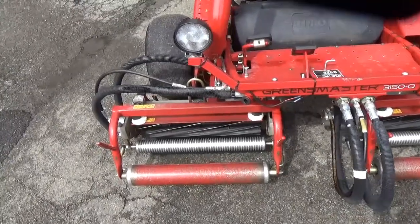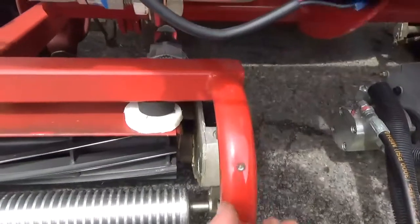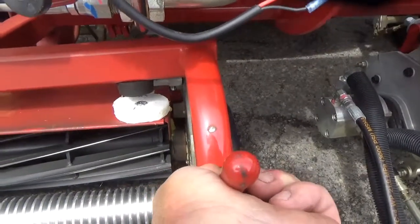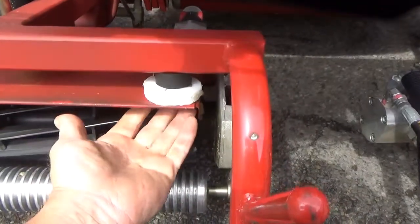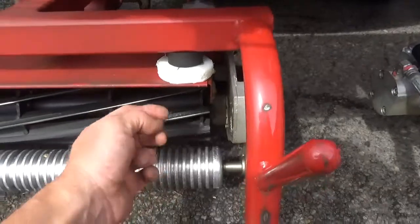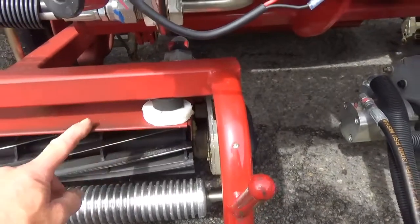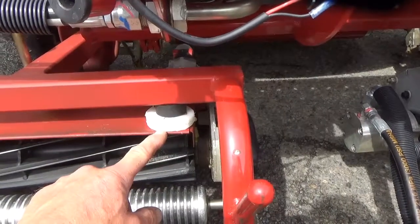This machine is brand new so it hasn't got those cracks yet, so it lifts higher in the first place, but over time it'll get those cracks. You can see these discs I put in here - that one's mounted to the reel and all it is is a plastic cutting board I cut up with a bolt hole in the middle, bolted right down through the top of the reel cover with a shallow bolt so it doesn't interfere with anything. I have not put the side bolt in yet because it doesn't flex that much, not cracked, but I'm going to do it anyway as preventative.